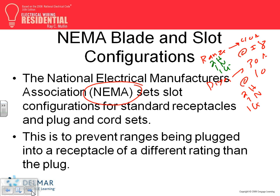There are devices that project a certain value, you have to leave an inch, code 2008. I'm not aware of any changes. They're trying to get to deeper boxes for these particular devices. You still can fit them. You don't have to design a box. You can have a deep 4-square box and get the depth. The depth is the issue with these devices.